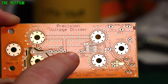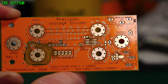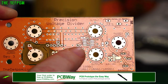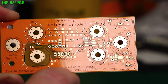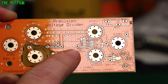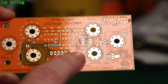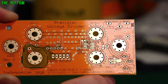So I'm going to try the ADA-4077 and see how well that goes. If I can't get the offsets correct, then I'll put in the OP-177 instead. Because the ADA-4077 has no tuning, it may not be precise enough - we'll see. In theory it should be but I don't know until I try it. The OP-177 does allow trimming, just like the original TL-081 does, and I can get that TL-081 really close. So the OP-177 should do even better if I need it.